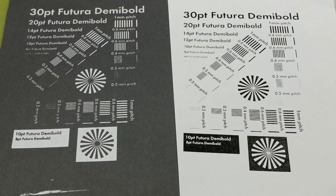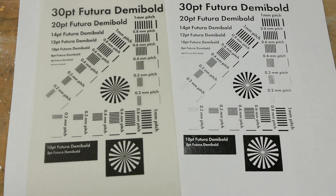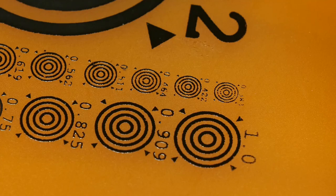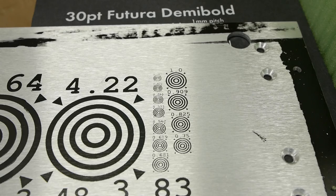With everything shown in the video you can easily get down to 400 or even 300 micron pitch. 8-point font looks pretty good, 6-point is marginal, and anything less than that doesn't appear to work. Side by side with the original artwork, my printer can print 200 micron pitch and easily get down to 6-point and maybe even 4-point font, so there's a little bit of loss going from the printed artwork to the screen printed result, but with a little tweaking and more care I think you can make it as good as a laser print in terms of resolution. The real strength of screen printing is that you don't have to use ink from a printer — you can use all these other materials and print on substrates you could never feed through a printer. I hope that was helpful, and feel free to put your questions in the comments.